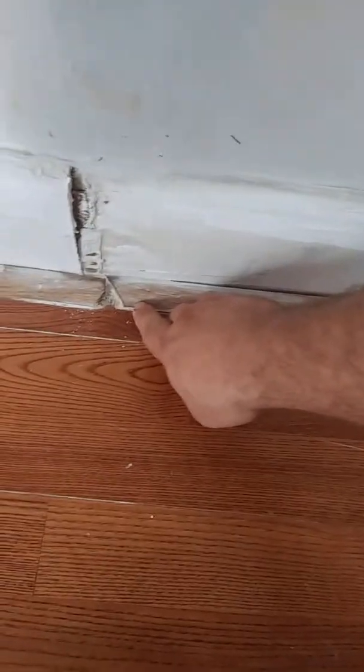If you don't put a fan in there you're going to have issues, and it's real easy to do because you've got that cavity. You can run power straight up through the basement into that cavity, put a fan here and vent it through this wall — that way you don't turn this bathroom into a steam room. So one circuit here for the GFI, one up here for the fan.